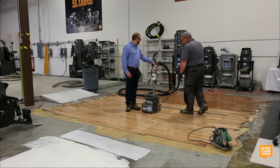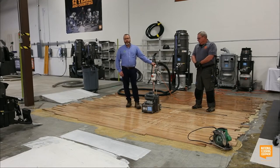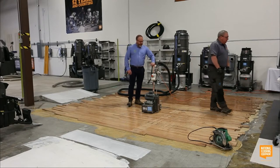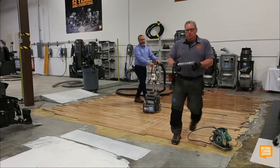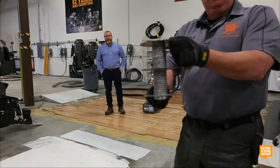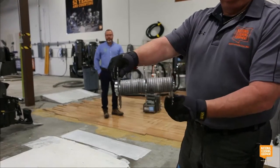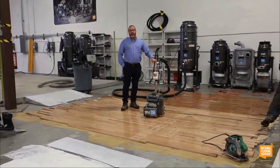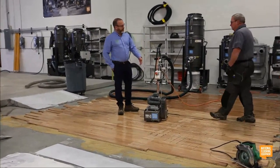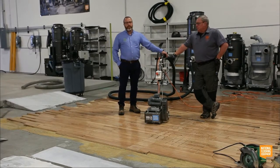National actually sells this tool. This is our 110-8 — a 110-volt scarifier. What's really great about this machine is there's actually a blade set. With this machine you can do the typical scarifier things: remove line striping, leave a shot-blast appearance on the floor. Or with that blade, you can actually cross-cut your hardwood floors without having to be on your hands and knees with a circular saw. As you can see, there is dust collection, which everybody wants — clean, clean, clean — especially with OSHA requirements on job sites.